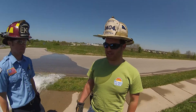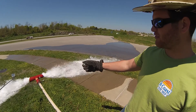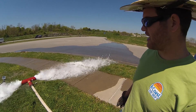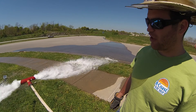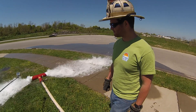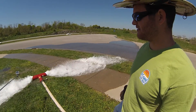The hydrant's now fully charged. We've got the water flowing out through the sides. We've got a pitot reading being filmed as it exits off both sides. This one's a little bit different because we have to actually flow water to get this reading — the other one you just screw on and you can get the pressure like that. But as long as you don't mind getting a little wet, this one's not half bad. Let's see how accurate this reading is.